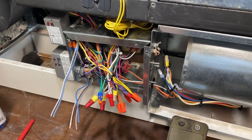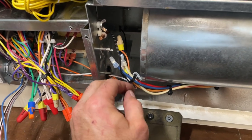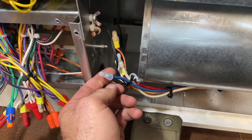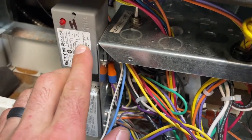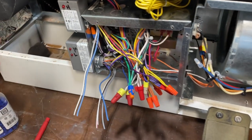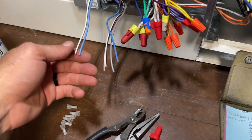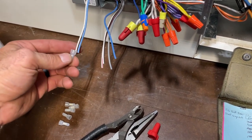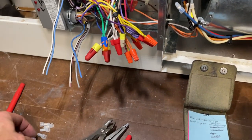All right, it's coming right along. Got my return sensor mounted. Always cap off your unused wires, because you will have back feeding, especially true with transformers and everything like that. So here are all of those. I just cut off the ends and cap them just with this. I don't strip the wire, just put it straight in there and crimp that.